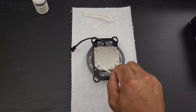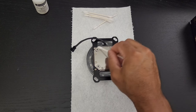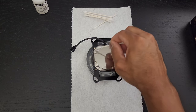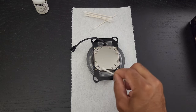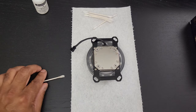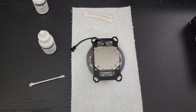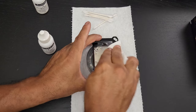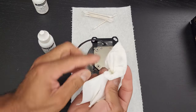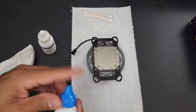You can see that in the grooves of the screws, some of the previous thermal compound is actually still coming up. But luckily, these grooves are not actually going to be touching the IHS on the CPU, so that's pretty good. Now let's use Arctic Clean number two — first let's clean all this off with a paper towel to remove the excess. A little bit does still come off, so I'm going to use a little bit more.